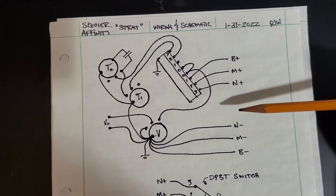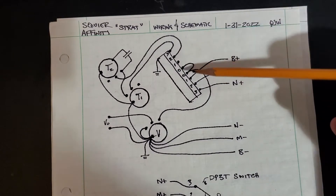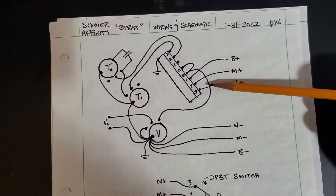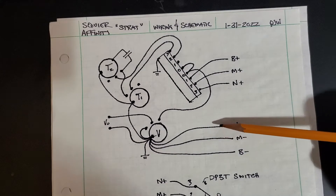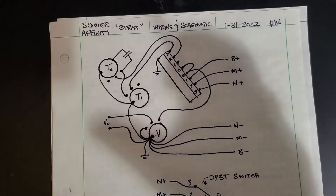I would call this a wiring diagram, and it's very useful if you want to mess around with rewiring the guitar. This one is made to look like an import Strat, so if you're not conversant with how electrical schematics work you could use this as a way to wire up your Strat if you have an import switch.